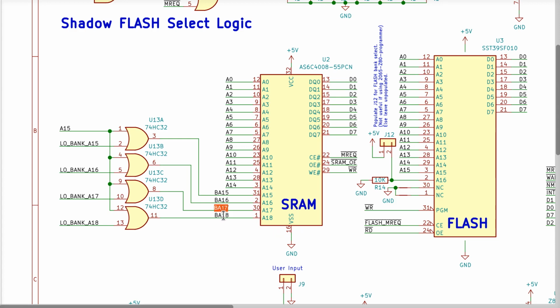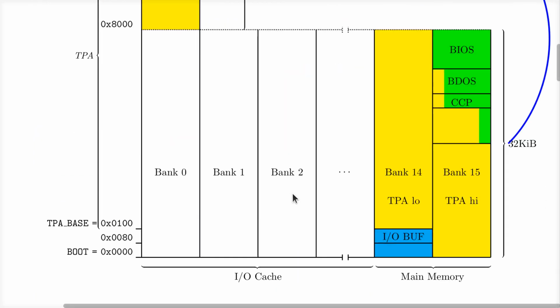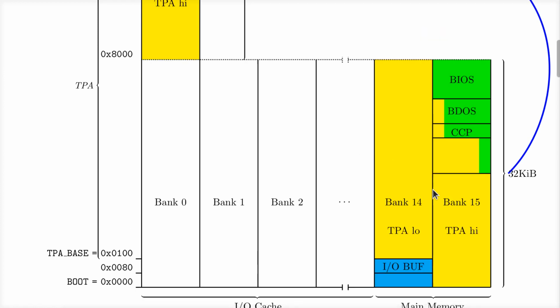So that means that bank in hex, if this is a 4-digit number, 1100 through 1111 would be the banks that we could use. Well, 1100 is a hexadecimal C0, and all ones is an F, right? So as long as the banks are always C0 or greater, we're good. Okay, so that means the last 4 banks out of the 15 total are the only ones we can ever use. Now, we're gosh darn lucky that bank 15 is part of the 4 banks, right?